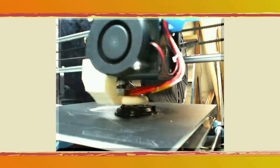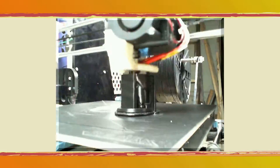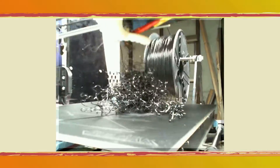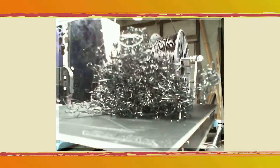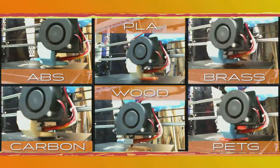The only filament I did have a lot of trouble with was the TPE or flex. The filament kept getting bound up in the extrusion gears. I did get really close on one print as you can see here, but unfortunately the nozzle hit the top, knocked over the little Rick, and I woke up in the morning to spaghetti. Luckily the rest of the filaments went off without a hitch.